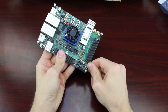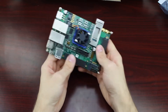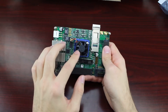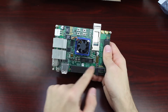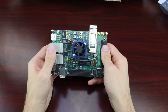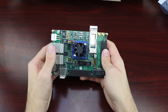There's a little switch to control the voltage for the PMOD. Speaking of simple input/output devices, we have a few push buttons up here which can control the reset of the programmable logic and processing system. We also have a few DIP switches scattered about — some for configuration of the board and some for user application. And in that same vein, we have some LEDs scattered throughout the board that can also be used for your own user applications.